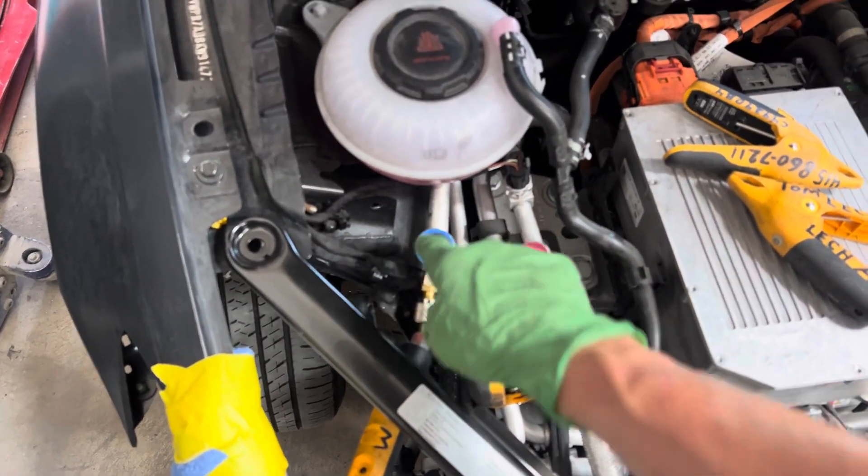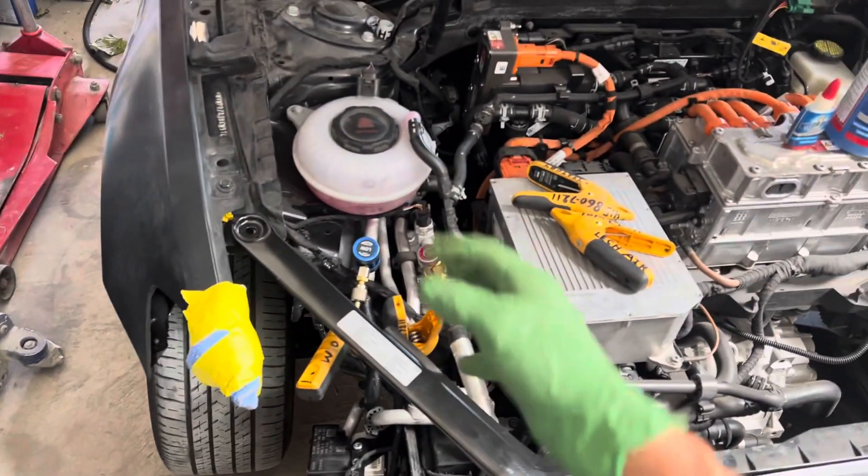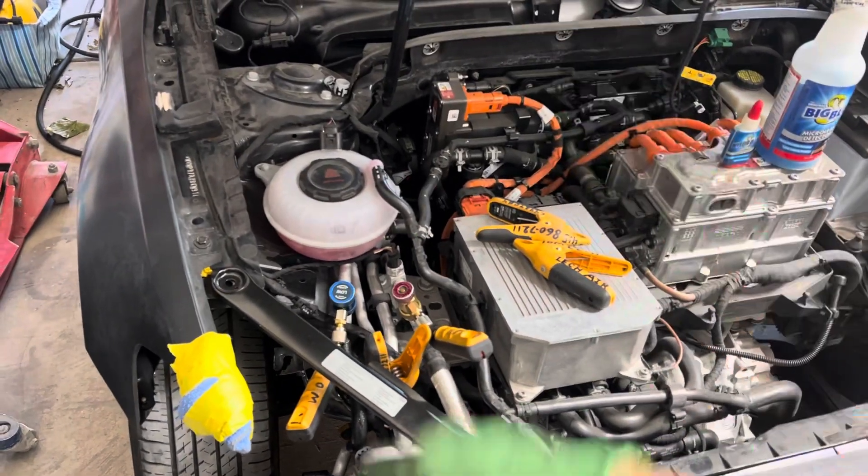Not positive pressure — negative pressure. Can you imagine somebody seeing negative pressure and the technician going, 'Oh my god, your expansion valve is bad, let's change the expansion valve.' Wrong.